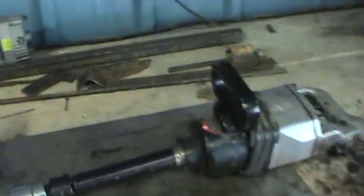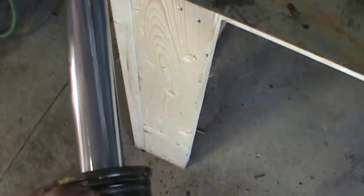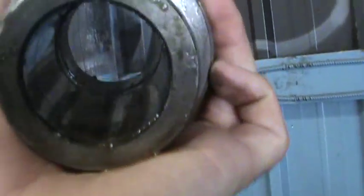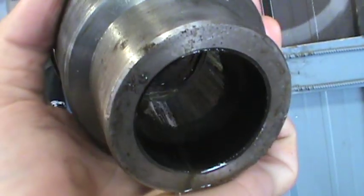Lucky for me I have pretty big impacts. You might need to buy one of those or just try whatever you want. So basically here's the rod when it comes out — it looks like this. This is your gland — this is the part that you've been prying on with a pipe wrench. See, this goes on it like this. Inside there's the poly pack and that does all your wiping. That black thing is a bushing, and in here towards my finger is the poly pack and the V-band.